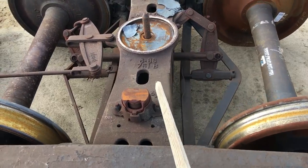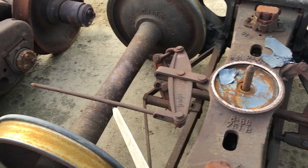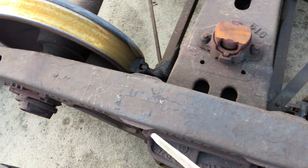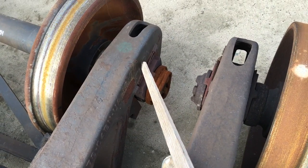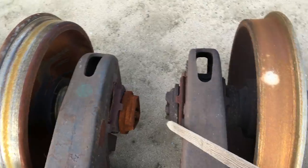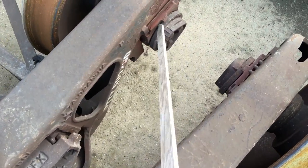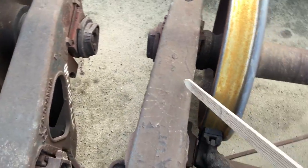So those are the brake beams. You have all these different brake levers — that's a brake rod. You can see we cut off the brake rod. We also have what adapts the side frame to the wheel set — these are roller bearing adapters. You can see them right inside here. That's what connects those two, or adapts those two.